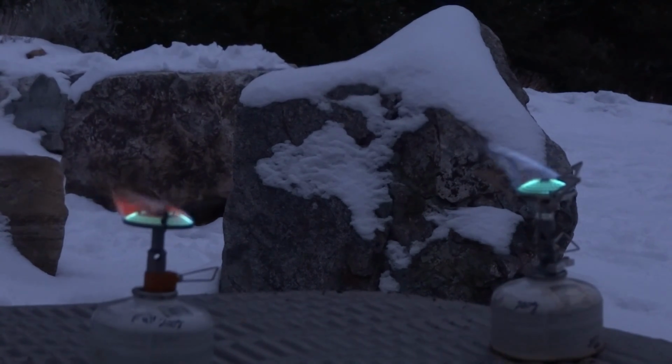I think part of the issue, of course, is that the microregulator can only regulate if there's additional pressure. You can open up a valve only so far. If there's no more pressure to come out, then opening the valve up further through the regulator isn't going to increase the flow of gas, because there just isn't any more pressure in the tank.